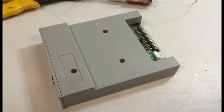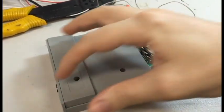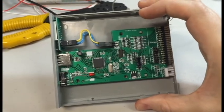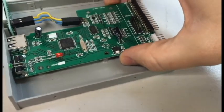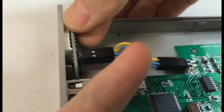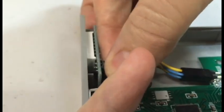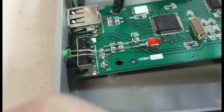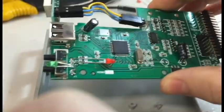The first step is to take the shell off of the GoTek device — just lift that top cover off after taking the three screws out. You'll see that the board is underneath, and it's really easy to get out. You simply lift up from the back side to pop up the two connectors. The most challenging part is getting the LCD out, but you just wiggle it back and forth and eventually it comes dislodged. And you just kind of slide it up and out. And there you have the board.